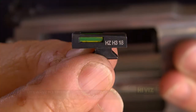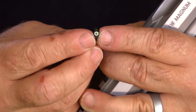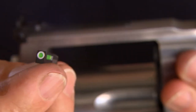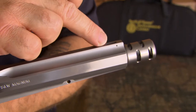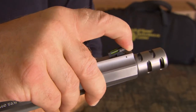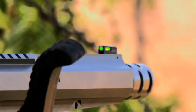We're going to replace the fiber optic sight with our new LightWave H3, which is tritium and fiber optic. It has a tritium capsule embedded inside the light pipe, with the light pipe exposed, and on the beading end we also have a white ring around it. To install these sights on the Smith & Wesson X-Frame — which has the DX type sight mount with a spring plunger and pin arrangement — you take the back end of the sight, hook it onto the plunger, and then push it down. That's as easy as it is to change.